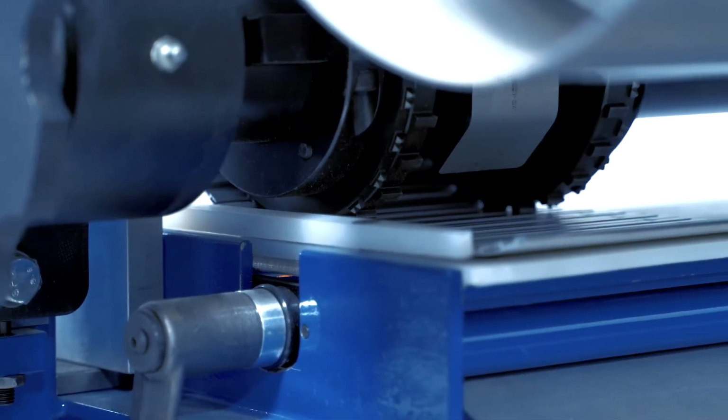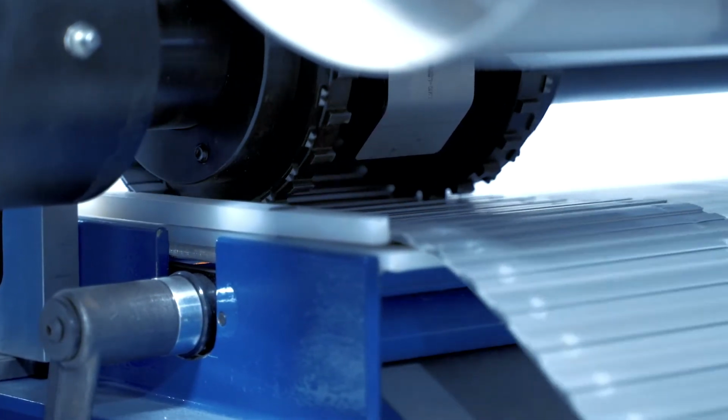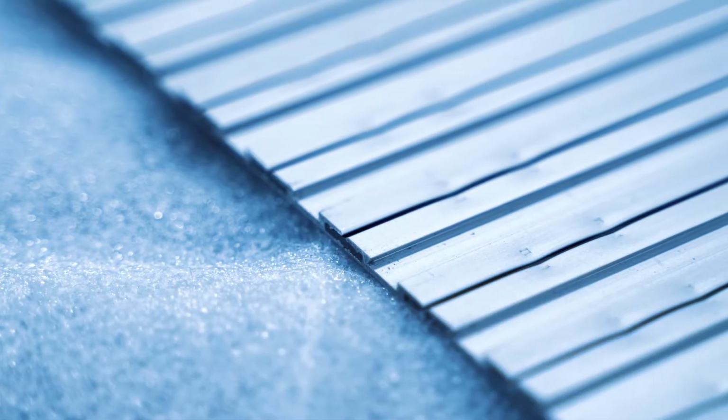The function of the machine is a crimping machine. It crimps the aluminum extrusions to the rubber joint. Basically, the apron cover is a series of aluminum extrusions with a rubber hinge in between. So they assemble them and they crimp it to keep them from sliding laterally.